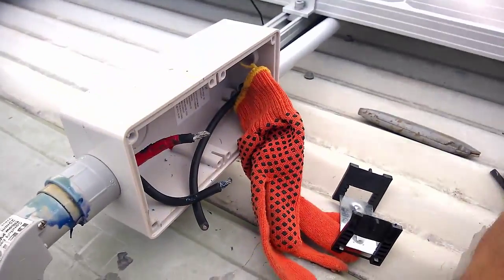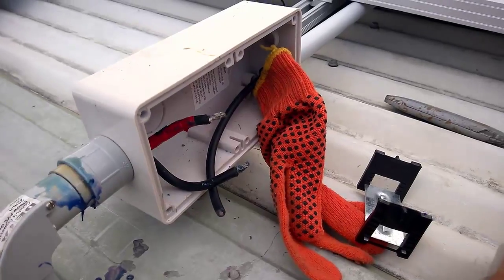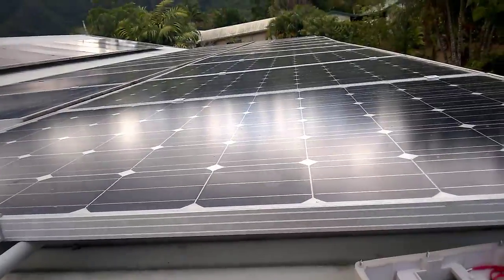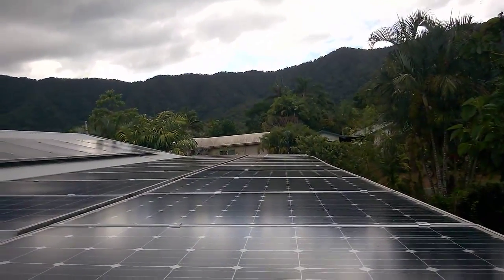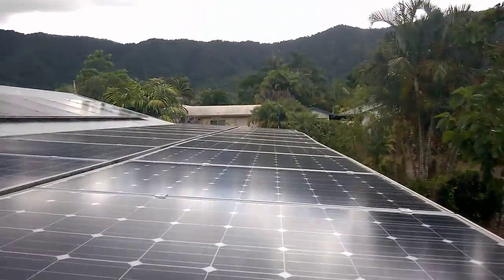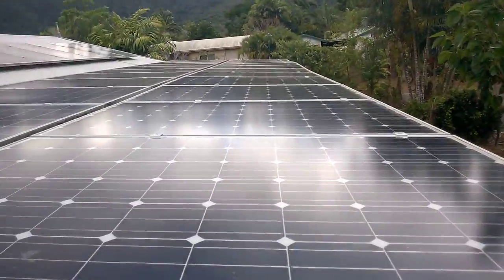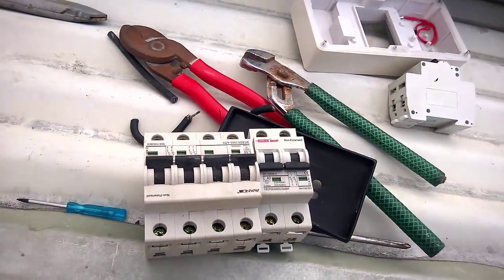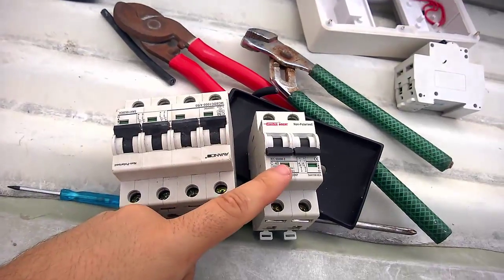Each of my wires will be rated for 40 amps. When I was running these panels, I was actually doing 41 amps just from these new panels I just put up — that's way more than what I calculated, or even what both me and Justin Casey calculated. So when I had a fire risk, I went away from these, brought different ones. I'm going to wire this one up and show you how it's done.